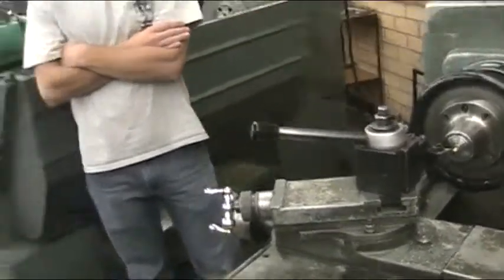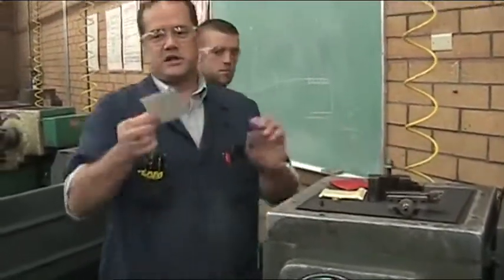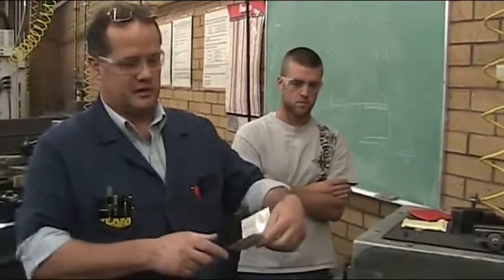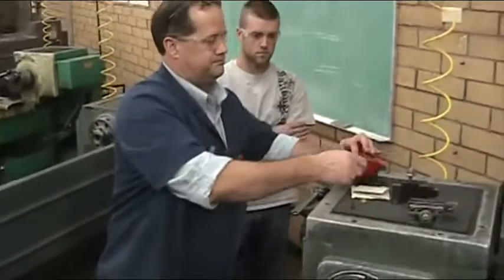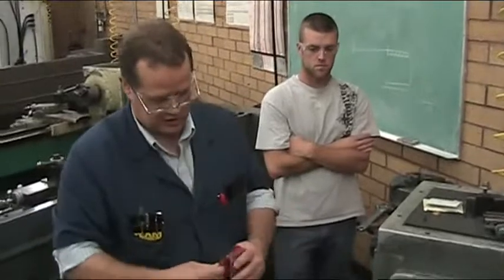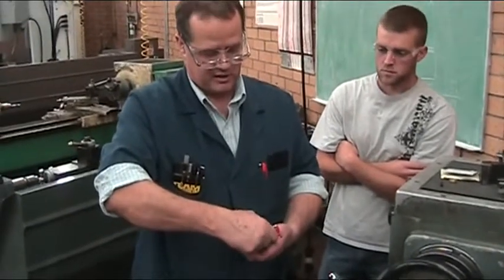Over here we've got our thread wires. They'll just be right there by my door. And this is the card that we actually looked at. Here's the chart that I had up there. So if you don't remember it, it's right there. Shows you how to measure the threads also on it. And we're going to look for number 29 wires when we get done cutting. And they should be listed right here, the size. It'll be these little tiny guys right there.